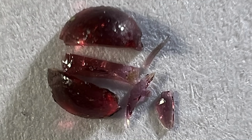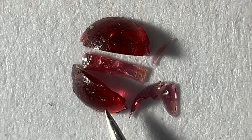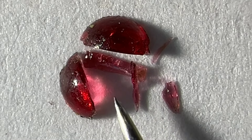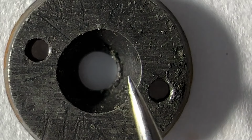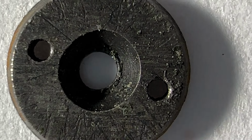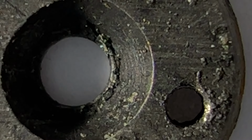It's a high-profile jewel. These aren't being produced today. Up close, you can see imperfections in the finish. Not a real high-quality jewel when new. This jewel setting cap wasn't finished real well. This burr should be removed so it doesn't cause any future issues with the next jewel.